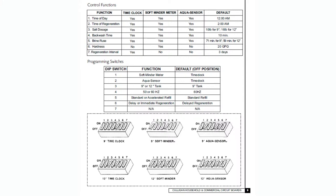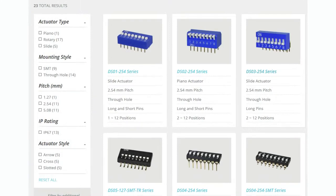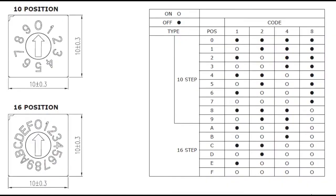The only problem is it's kind of hard - you have to have a manual which actually says like, okay, this one's on, this one's off, and you have to have these little drawings. That said, if you want dip switches, CUI makes a lot of dip switches and we use dip switches a bunch, especially the SMT ones which are great - you just pick and place them onto your design. They come in right angle, slim, surface mount, and piano style is my favorite. But what you can do if you have a four-switch dip switch is instead of having a binary code table where you have to tell people for configuration one flip the first one, for configuration two flip the second, but for configuration three you have to flip the bottom two - because you have to do binary code - instead, if you have a rotary switch, it's a rotary dip switch. It does the encoding for you.